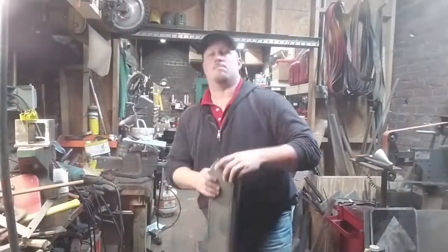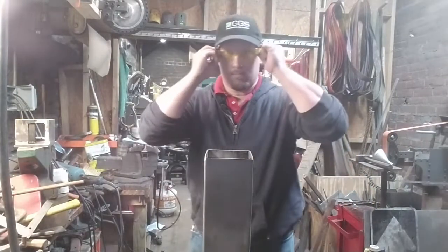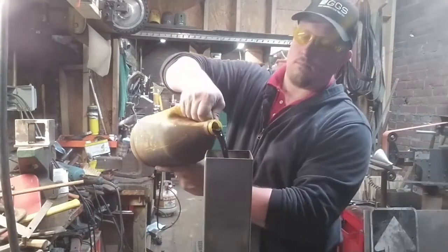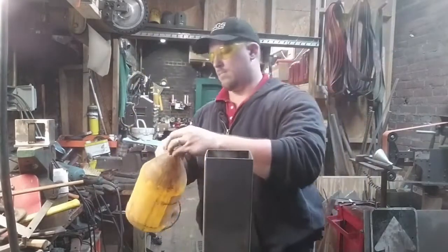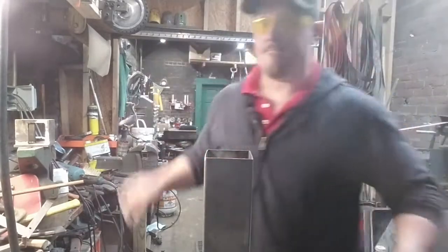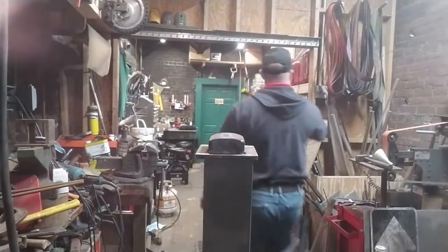And then we go ahead and we put it in ferric chloride. So we're going to go back to our little piece of stainless pipe. We're definitely putting on goggles. And then for this we're going to use straight ferric chloride. We have about 1 gallon, and that'll be enough to cover the blade. We'll go ahead and drop our knife in carefully. And then we're going to leave it. We will leave the knife for about 4 hours, and that'll be a very nice deep etch.